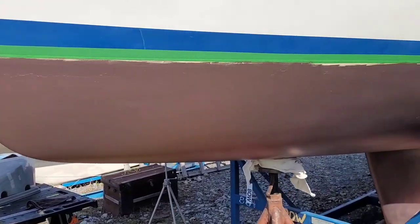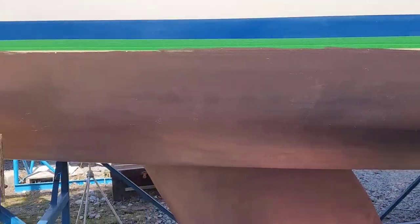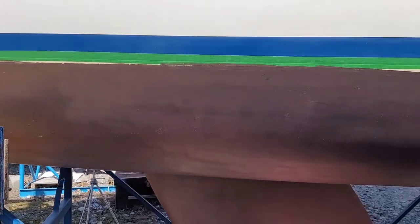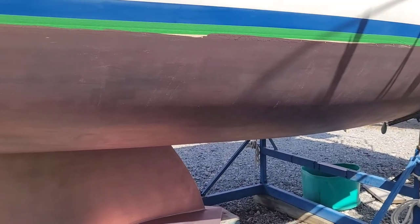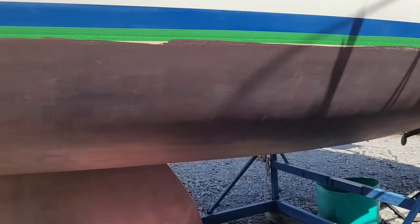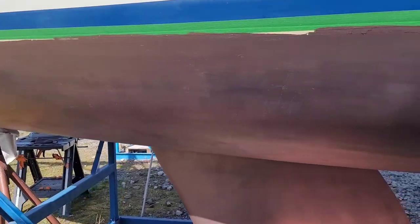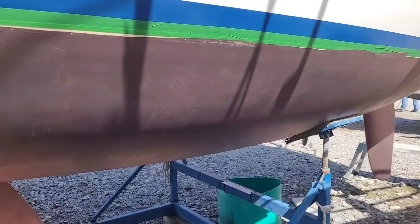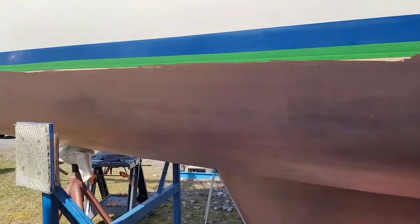One of my fellow members asked me how come it's not blue. I told him this is the year I paint the anti-fouling blue — and this is indeed the blue VC-17. However, it turns blue once she goes in the water. When you first put it on out of the water, it appears to be a bronze color, but it will turn blue once it's submerged. That's a good thing to know because the can says blue, so when you start painting and see a bronze color, at least now you won't worry.